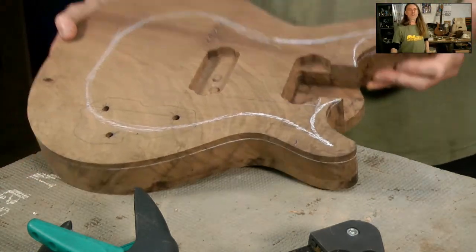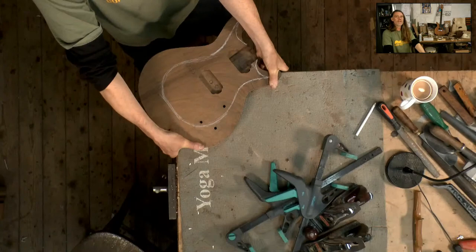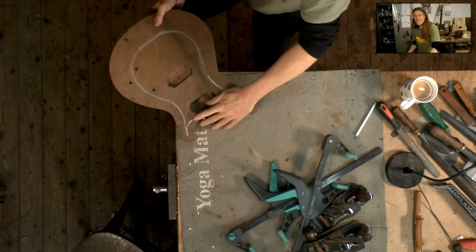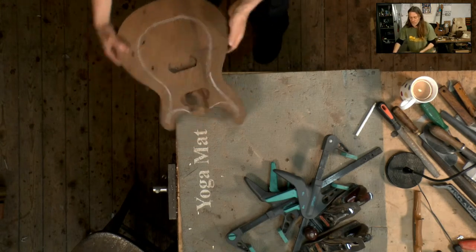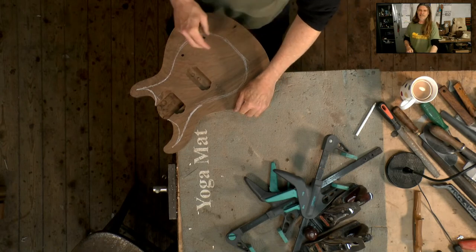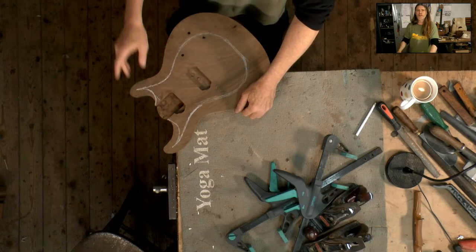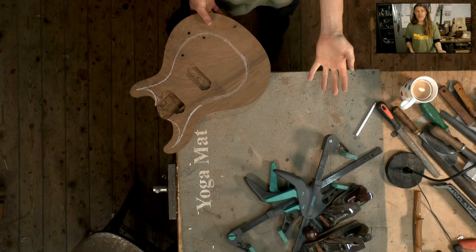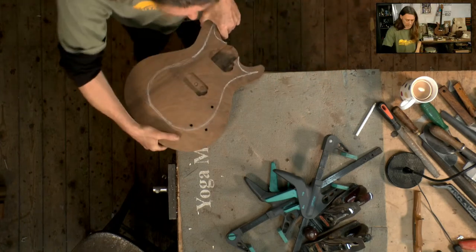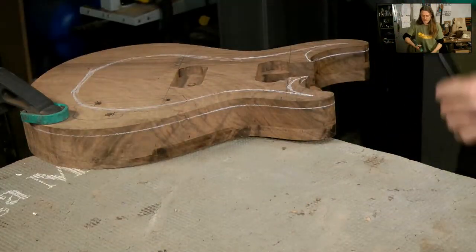Right, so when we're carving, I've got three positions. Position number one like this. Overhead cam, brilliant for this. And then I can carve this part of the guitar. Position two is there. And I can carve all around the back. And then position three is there. So there's three positions that I have to go through. And there's two stages. So stage one, I have to go all the way around. And then that is stage one carve. Now you could call it finished at that stage. Or you can carry on and do the full carve. So time permitting, let's see how we get on. Hopefully I'm going to get that all done. So stage one carve. Clamp to the bench in position one.